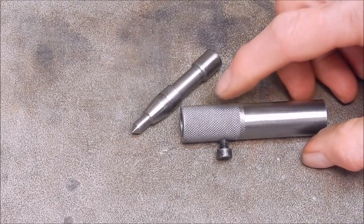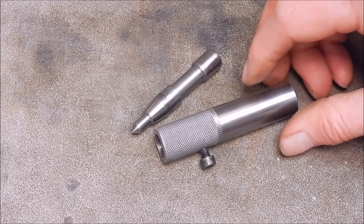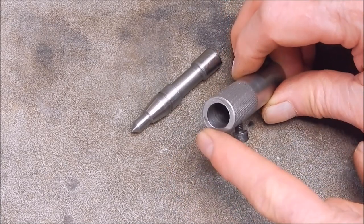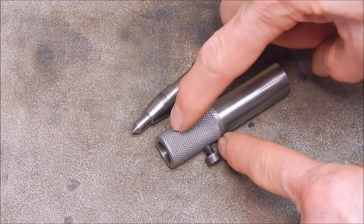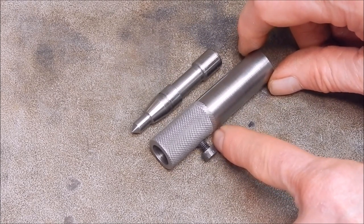Now, the body is made out of good quality machine-grade steel that I had. I drilled it and then ran a boring bar up it — that's a pretty fair length to use a boring bar on, but it was all doable. No problem whatsoever.